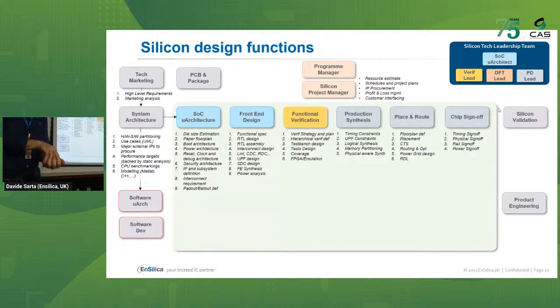Because there is an easy solution, which is you put a CPU farm and an interface to capture the data, and then you put the data into a memory, and then the CPUs will do literally everything. And then the only thing that you need is whatever interface to stream everything out. Is that an acceptable solution? It's extremely power hungry when you do this. It's likely to be very big. And the complexity of the software is something also to be appreciated and controlled. So this is just an extreme example to give you an idea.